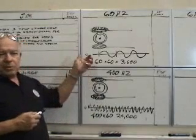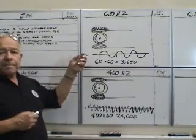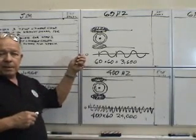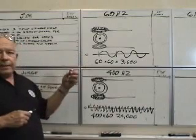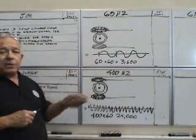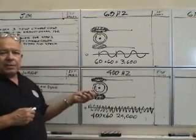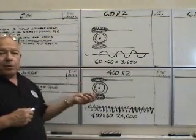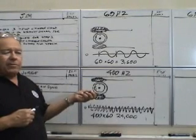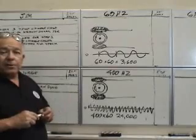Plus the fact that most aircraft motors use special materials and insulation where you can run them a little bit harder. So we find that in application, our power-to-weight ratios are ten to one. We can get ten times the power for the same weight motor and have it very, very reliable. That's basically what 400 Hz is.